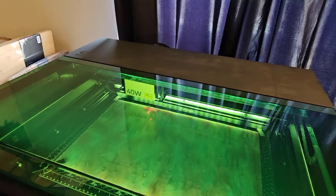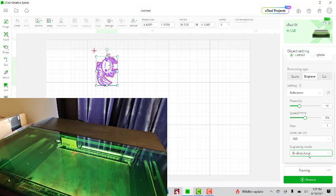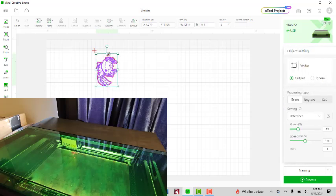So it's a perfect way to get everything perfectly aligned. The next thing I need to do is set it so that the purple parts are engraved and the red parts are cut. The engraving settings — I'm just going to go with what they have already. 30% power, 300 millimeters per second speed, one pass, lines per centimeter. Bi-directional means it engraves both ways instead of just left or right — twice as fast that way. The red part we want to cut: it'll do 8 millimeters per second, 100% power. That seems a little slow, but we'll give it a shot. My hundred-watt is two and a half times more powerful than this, so I'm thinking maybe 10 or 12 would probably work.